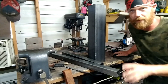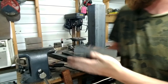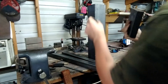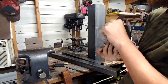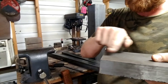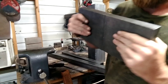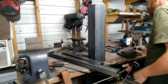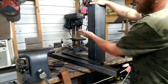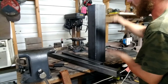This here is a five-by-five, quarter-inch thick wall tubing — I got this as a drop. All of this steel was found on the drop shelf; I didn't have to have anything cut. If you can get away without getting anything cut at the steel supplier, you're going to save money because they charge you per cut. These are going to be just the plates that go to the top of each of these to put my dies on — I got two of these. They are six-by-six, so we're going to have a half-inch overhang all the way around that we can weld. We'll do what they call a mound weld, where you layer it and just keep stacking. These are an inch and a half thick. We're going to be cutting this two-foot piece in half for the top and bottom — we may cut a nine-and-a-half-inch piece for the bottom and a six-inch piece for the top, that way we've got some travel between our press dies and can work on some bigger stock.